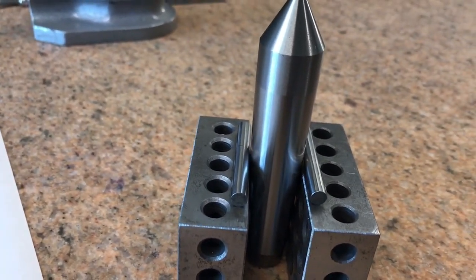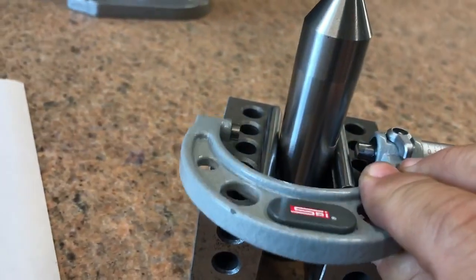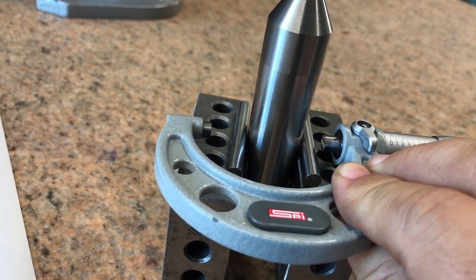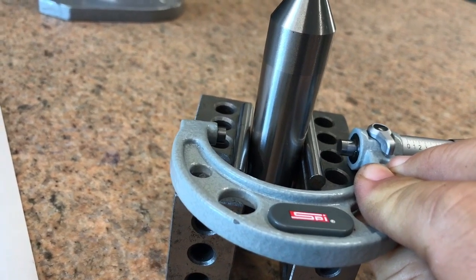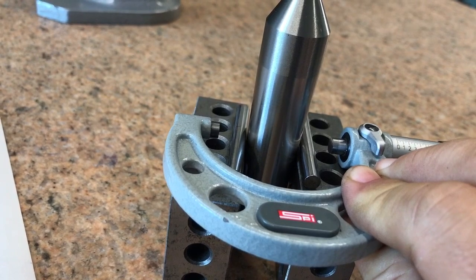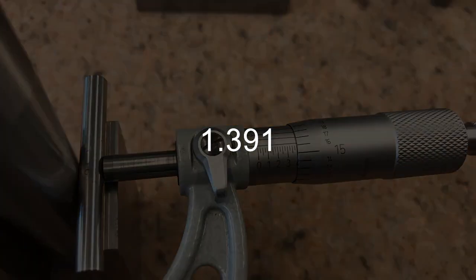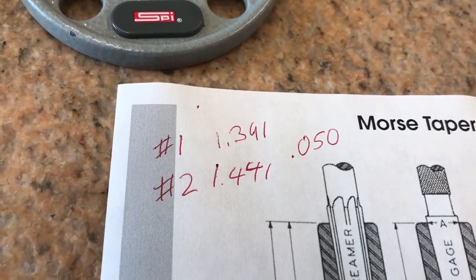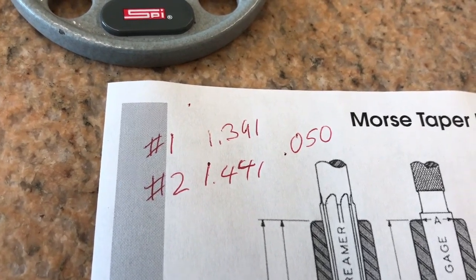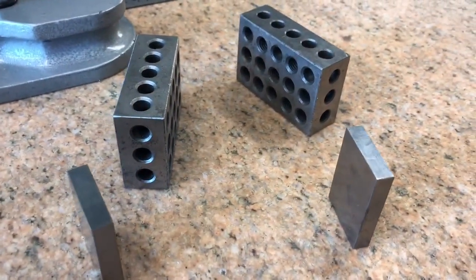One thing to note: I've had some micrometers that are not compatible to do it this way because the micrometer body doesn't allow you to get down in there. So I'm going to switch this out to two gauge blocks — a two-inch and a three-inch — and measure across those two points instead. The same concept applies, it's just that with this pin diameter I cannot use a 1-2-3 block; I have to go to a bigger pin. My first measurement is 1.391, my second measurement is 1.441, so I ended up with exactly 50 thousandths difference — perfect.